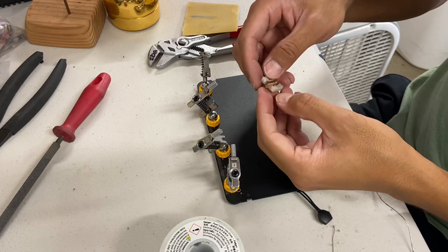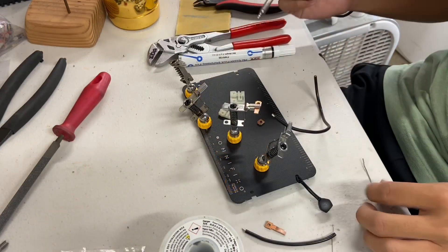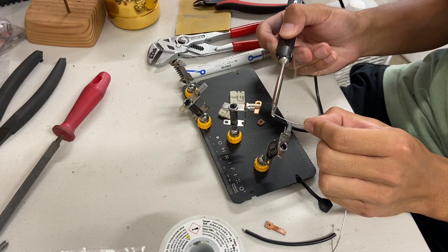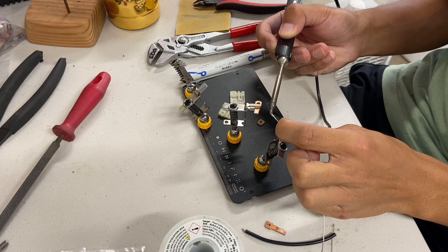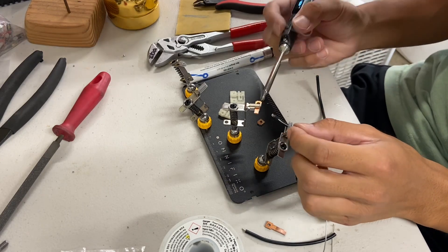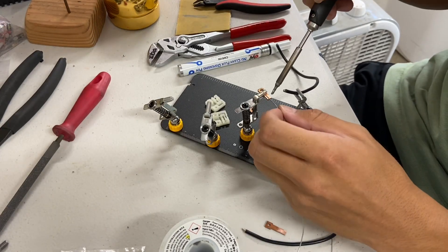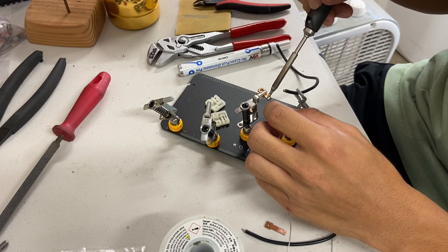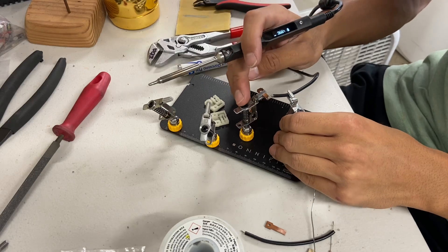Once you have that, you can remove both tabs. I like to start with the battery lead, so I'm just going to tin this. I like to switch the negative side of the robot so in case your robot becomes electrified or the chassis becomes electrified, when you turn on or off the robot it won't arc to your switch. I'm just tinning these — a little flux helps but it's not necessary. I didn't use flux this time.